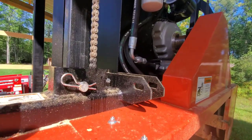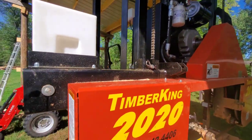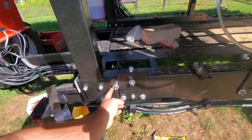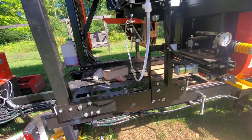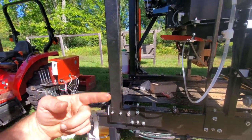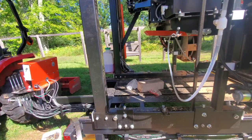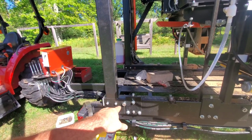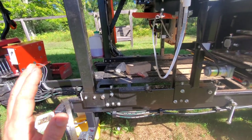On a new mill it's not uncommon to get hydraulic leaks on any of your hydraulic connections. Also important: there are four zerk fittings on your carriage that allow it to travel down the track. Make sure those zerks are being greased, because the roller inside — if neglected — can develop a flat spot and cause your mill head to lope unevenly down the track. You don't want that if you're cutting quality lumber. There's no seal on those so you can put as much grease as needed.